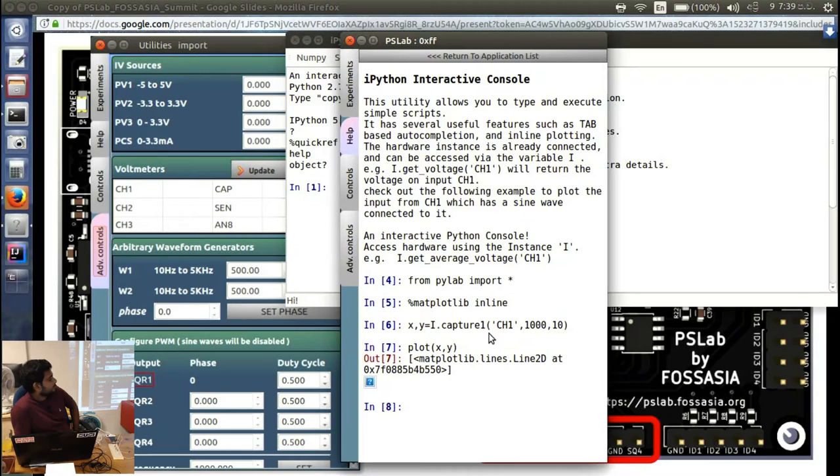So what's the communication between the platform right now? It's UART. So it's serial communication. Okay. And I think you guys discussed Bluetooth at some point. Yeah, Bluetooth and Wi-Fi, to make it wireless. Okay. And so actually the current hardware can be extended with an ESP.